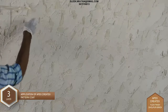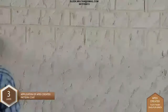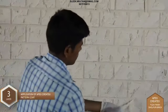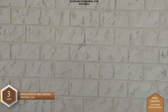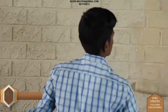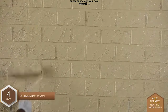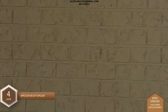Remove the masking tape immediately. Allow the coat to dry for 12 to 16 hours. Then proceed with application of the top coat. Apex Ultima is applied using an exterior range roller. Make sure that the top coat is deposited uniformly. Allow a drying time of 4 to 6 hours between successive coats.